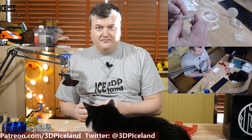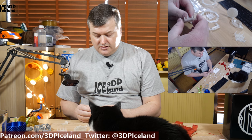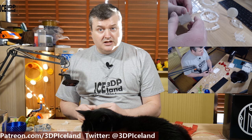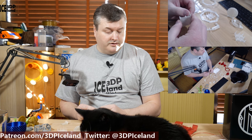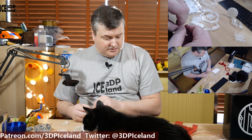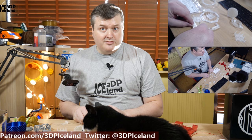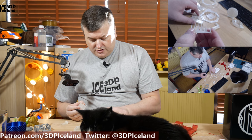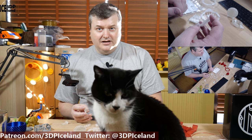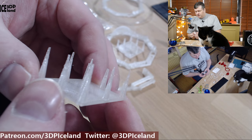After having several prints with terrible stringing issues, I reached out on Twitter and gave PolyMaker a tweet. Within maybe five or ten minutes I got a response from Chelsea at the KaosCoretech channel — she paints all the models Garrett creates and has been printing a lot with PolySmooth. She gave me pointers on her settings. After about two hours I also got a response from the PolyMaker Twitter account. After changing to a lower temperature, increasing retraction, increasing retraction speeds, and disabling Z-hop, I got pretty good results. I thank everyone in the Twitter feed — Chelsea and PolyMaker really helped out.